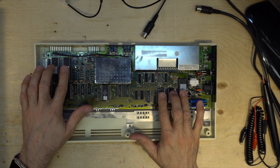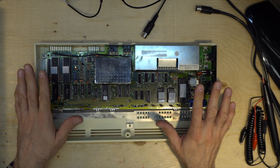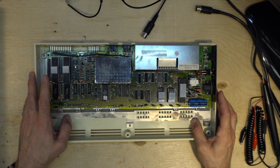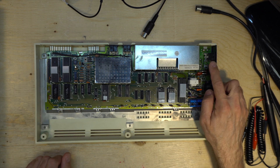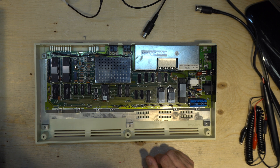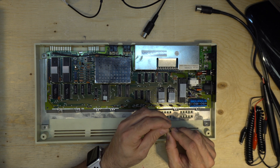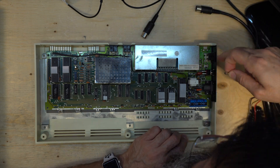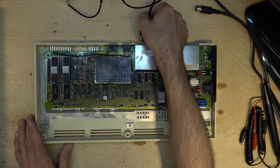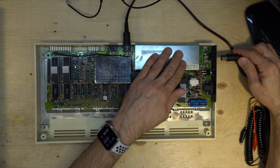I already made some changes — I've put some heat sinks. I already solved the problem with this one but I'm going to recreate the process I took to arrive at the correct answer. First, there is no fuse here. So I have a spare fuse: one amp, 125 volt. It sends one amp on the board. So that's one thing taken care of. We'll connect the video out and a power supply.